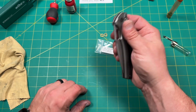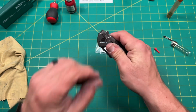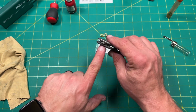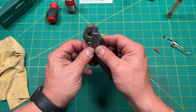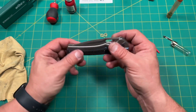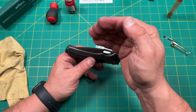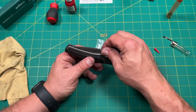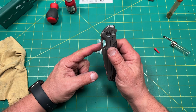And when you release it, now it slides into that little groove over there. You saw we had to move it in and out of that groove to get past there. Well, it slides up and it holds it, but it's at an angle so that it's just a ramp. It just overcomes that ramp, and that gives you the feeling of a detent ball in that little detent hole, and there's sometimes a detent groove that it goes through. It just has to overcome that. So what we're dealing with is not a detent, but it's a plunge.